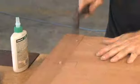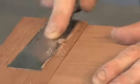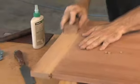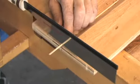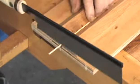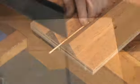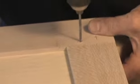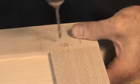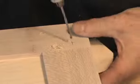Regular dowels work great for pegs. Drill a round hole, drive them in with glue, and saw and sand them flush. Hardware store dowels make good pins, but there's better stuff available. Bamboo, a strong and resilient material, makes fantastic pins and pegs. Even better, it's available in 1/8 inch diameters, sold in packages as bamboo skewers in grocery stores, or in 3/16 diameters in the disguise of bamboo chopsticks from your favorite restaurant.